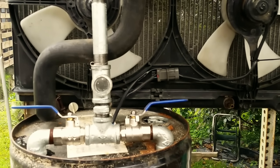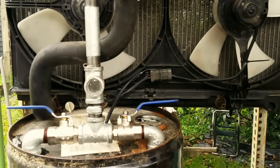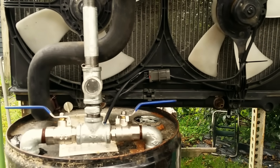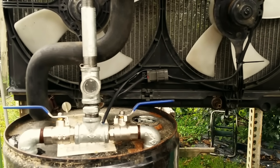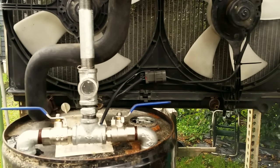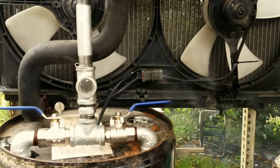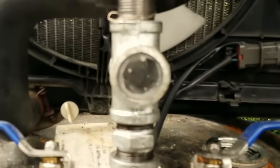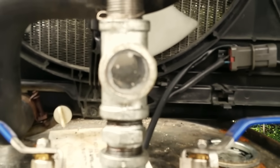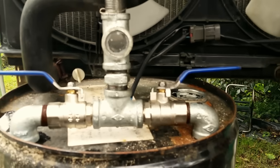This piece of piping will be attached to the condenser and will allow me to separate the devil's brew — which is the first few minutes worth of production before we reach temperature — from the real diesel. The sight glass here will allow me to see the product dripping through the pipes and adjust the valves appropriately.